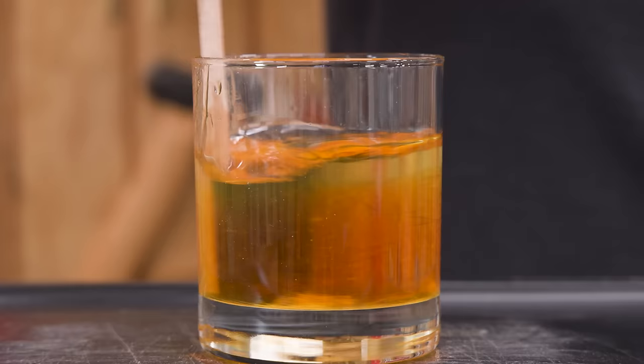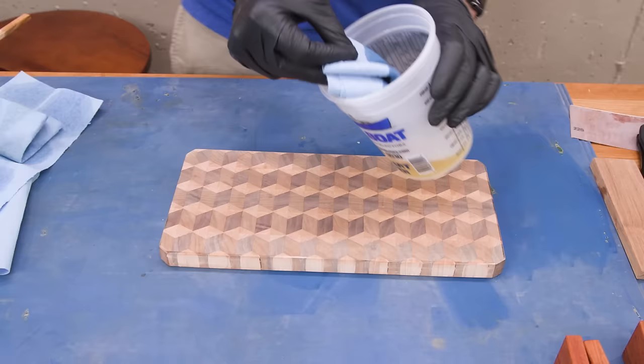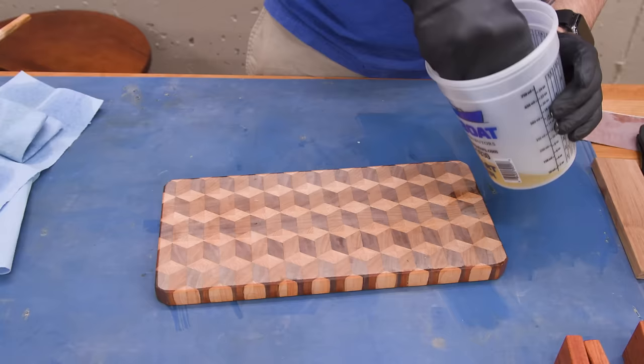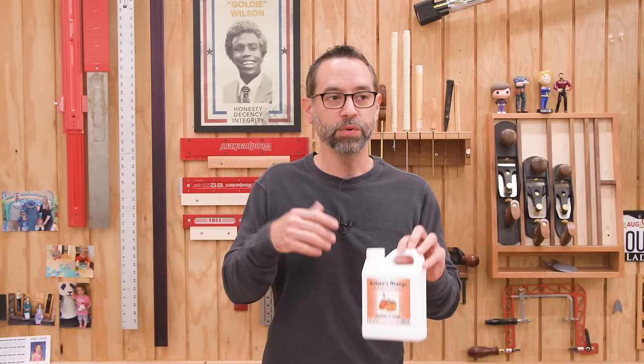I should also talk about solvents. Generally in woodworking, anything we call a solvent is not something you want in your body. But adding solvents to oils can be very beneficial from a finishing perspective — it thins the finish, allowing it to penetrate deeper and go on thinner, which helps promote curing. Thankfully, there are a few food grade solvents generally recognized as safe by the FDA, like this citrus solvent. It comes from natural products — it's made from orange peels, and smells great. While you don't want to gulp it down, it is safe to mix with oils. Once it hits the surface, it evaporates and helps the oil penetrate deeper into the wood fibers, leaving nothing behind on the surface.